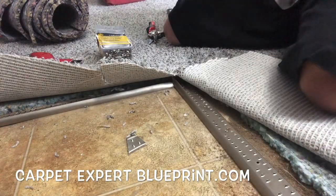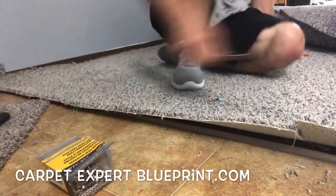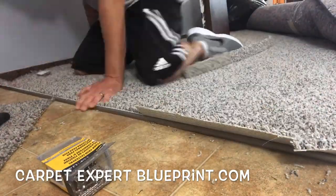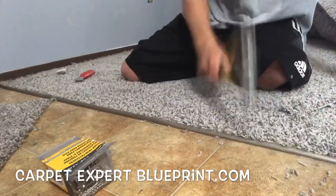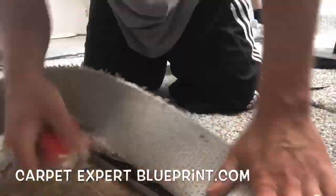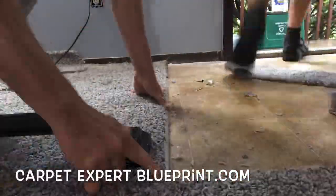Now it's showtime. Everything's lined up. We're going to finish putting nails in all the way across. Get the kicker, tap it up, crease it on, take your knife, cut it down, go ahead and tuck it in, working it all the way across. Smack it with a hammer a couple times, then do the other side — smash it down with the hammer and bam, that's how you do that. Comment below with any questions.